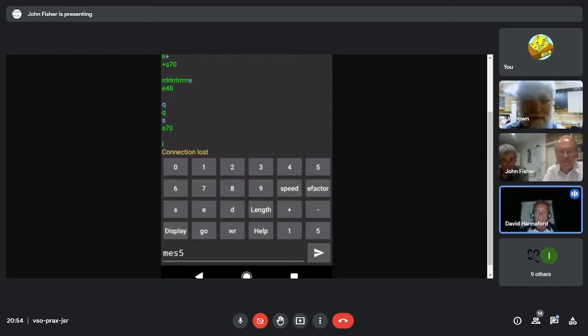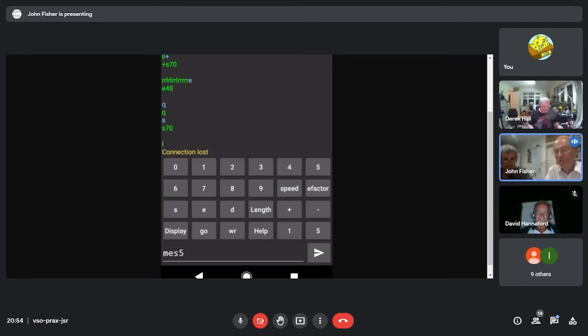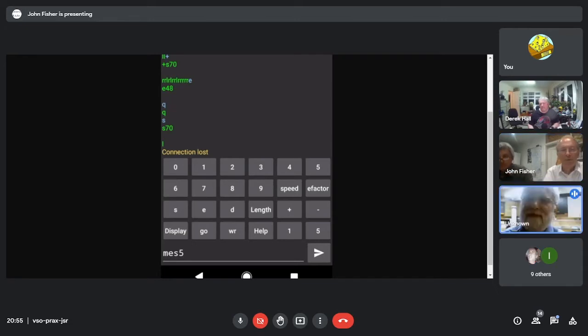You will probably find that they're very keen to run them at the maximum speed. I know. And so if you do put 12 volts on it, I guarantee you'll be blowing some motors up. Well, they could try different motors. These are 30-to-1 moderate power. We've got a 30-to-1 high power one, but I think we've got some 20-to-1 motors coming, which will be 50% faster. And then there's, of course, bigger wheels. Tyre materials are probably more interesting than anything else. So you might want to do a whole range of experiments with soft O-rings and things like that. It makes a tremendous difference to the performance you can get.